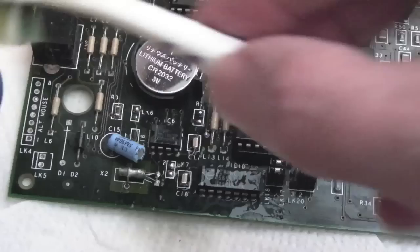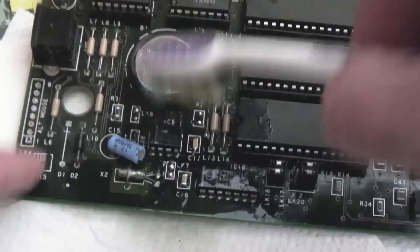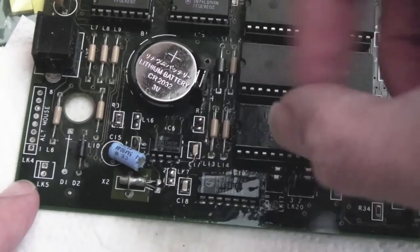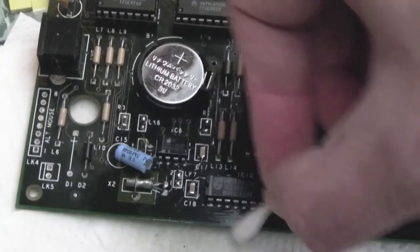Anyway, you can see that's looking all right now. The main thing is we did clean up around here because these resistors and caps and things here were terrible. These two particularly needed swapping out totally. You might just be able to see there was a tiny bit of kynar just from the trace to the bottom end of that cap there. So it's not quite as tidy and clean as it could have been, but you're always going to lose pads and things on these if you're not careful. Corrosion will just eat through things, and in some instances you do lose the pads. Anyway, that's looking a lot better now, I think.